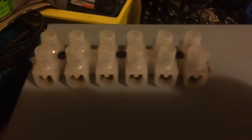I've drilled and screwed a six-point connector block onto there — you can use any kind of connectors, I just chose a connector block because it's easier. Once everything is soldered and heat-shrinked, I'll put cable ties around everything to keep them tidy so things stay cool. All the wires connect into there giving you 12-volt positive, 12-volt negative, 5-volt positive, 5-volt negative, 3.3-volt, and your main ground, then we can label them up.